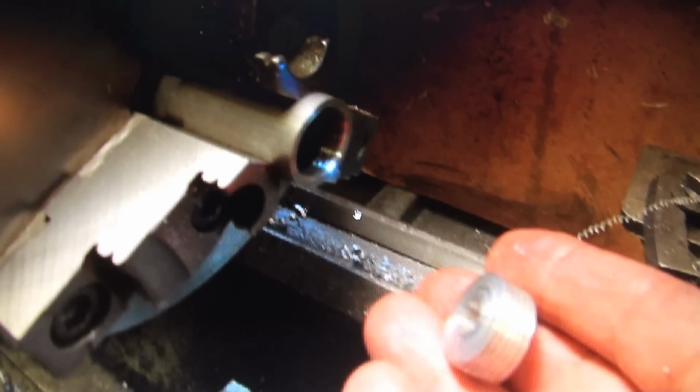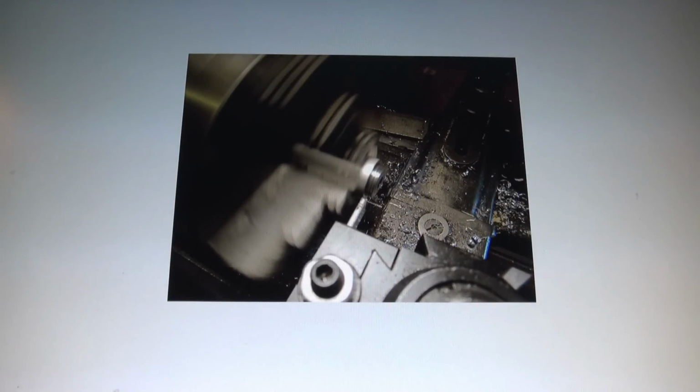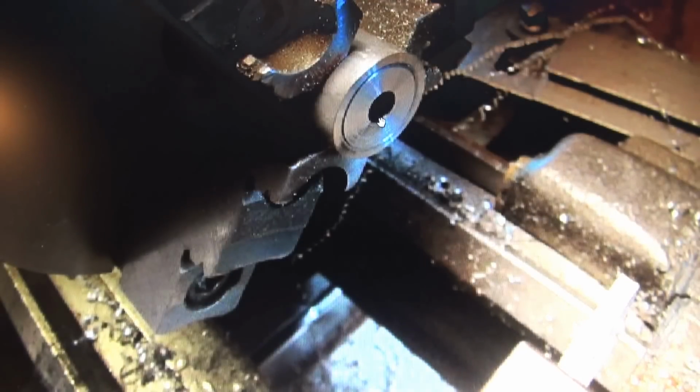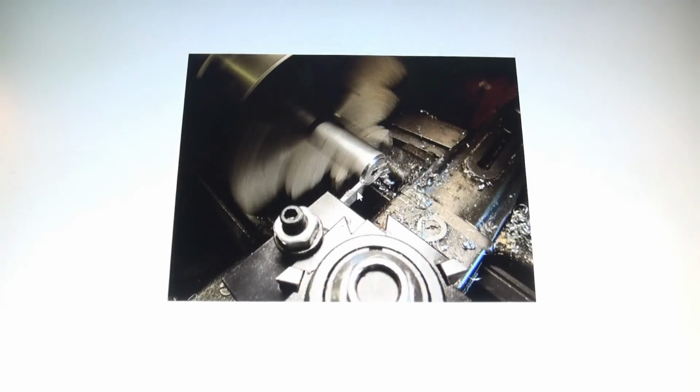Now, the whole ordeal with this is the piston sleeves are very thin. They have to fit inside the piston, and the spring has to fit inside that. So by the time you're done, it's like 27 thousandths. So here with a piece of aluminum that I already had threaded and tapped, why waste a good piece and bore it all out? I knew I could do something with this. So I found this plug, I stuck the plug in, and the idea was to then cut the plug off, right? Like you see here. And then take it and make it thinner by machining it back more, so that the plug that's in there is very thin. That's going to be the bottom where the spring hits.